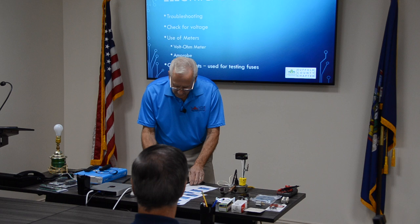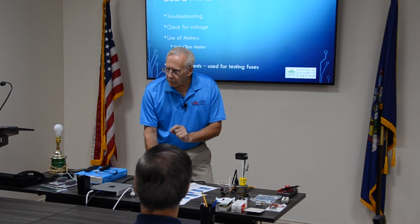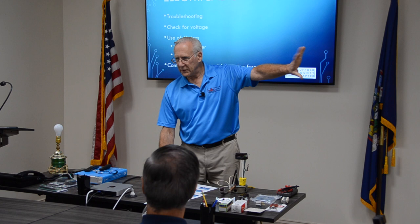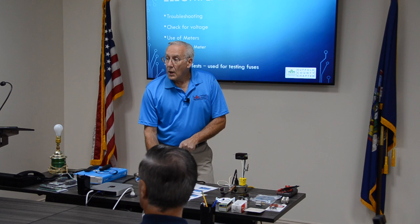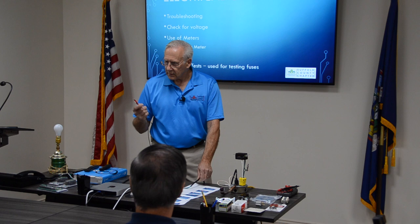The important thing I want you to take away from this demonstration is the reference point to earth when you have to touch the stuff. That's what I want you to remember when you walk out that door today. You don't have to worry about what a Y looks like or a delta. I just gave you that for me. But this, I want you to remember. You don't want to be that reference point. I don't want this going through you to get to the earth, because the earth can take anything you give it, and it will kill you to get there. Electricity is like the virus, it doesn't matter.